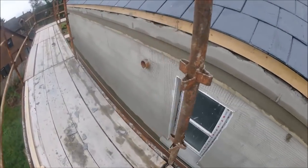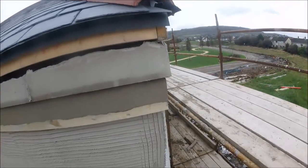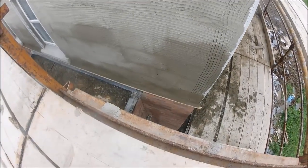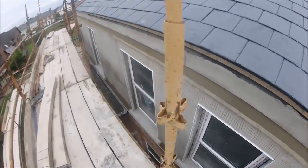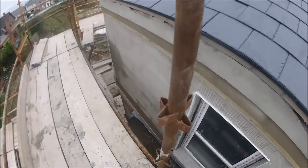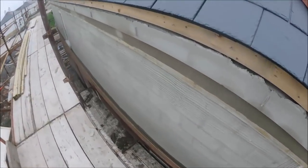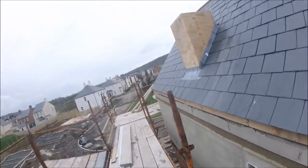It's a wee bit different — a double step bond at the top and around the front windows. It's definitely a good design. If I were going to pebble dash a house — say a country-type house — I would probably do something similar at the top. The reason being, in the country, birds like to nest on pebble dash houses up in the corners onto the guttering and fascia board, using the stones as a foundation. When it's smooth like this, they can't get a grip for their nest and they'll move on.